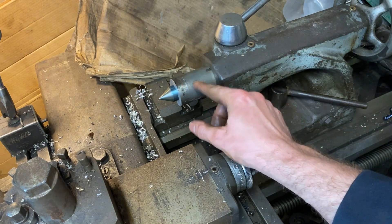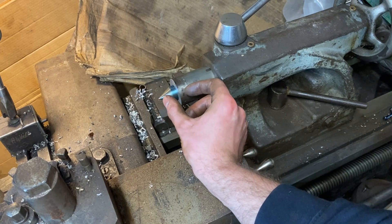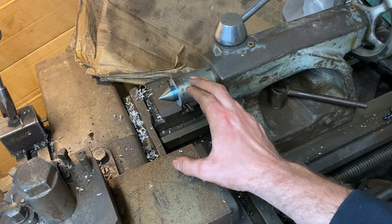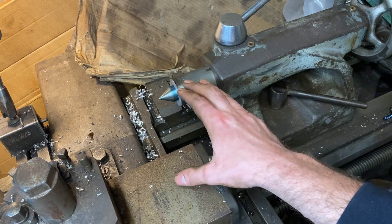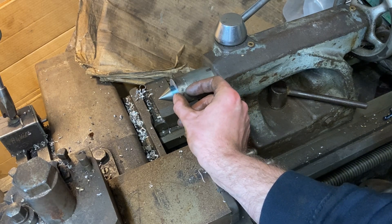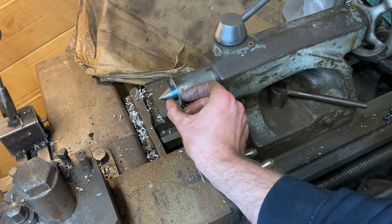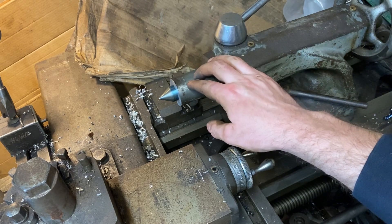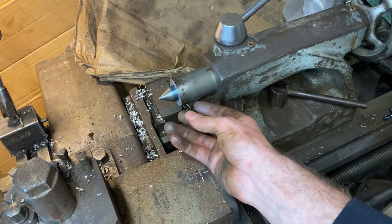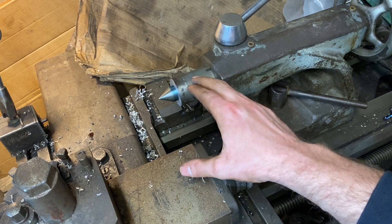If you plan on doing this yourself, just be prepared to lose some length of the quill in the tailstock, because we've had to remove quite a bit of material — more than I expected, to be honest. If we'd have removed all the damage in there, we'd have been losing even more. I stopped because there's a trade-off between the damage left in there and what's acceptable versus removing it all for the sake of it. If we'd removed any more damage, we'd probably have been taking another 10mm off, it's surprising how short it is in comparison to how it was — probably lost 5, 6, 7mm off there. But overall, very happy with that result. The centre now grips a lot better than it did before, and so do the drills — it's just a case of dropping them in and they automatically grab, rather than having to give them a tap beforehand. Not that it didn't grab well enough before, it's just going to be a lot better now.